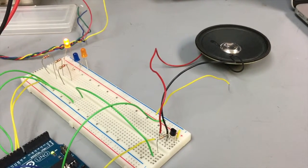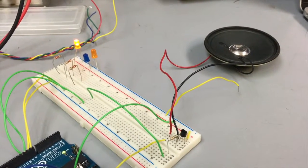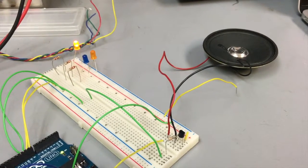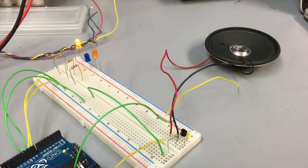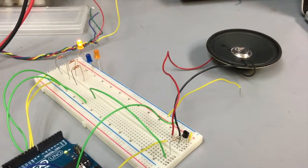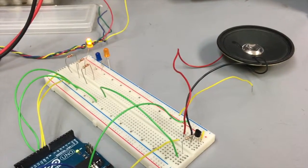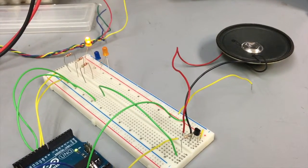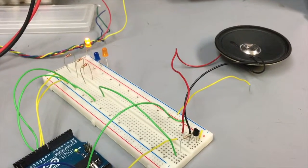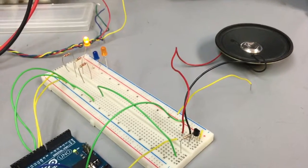You're also noticing one of the side effects that we're going to be mentioning inside of our paper. Sometimes what ends up happening is when you cross one of the thresholds, LabVIEW sends a little bit of information over to the Arduino, and there's a delay in that send process. It kind of keeps LabVIEW all tied up, and because of that, it ends up calculating the beats per minute wrong. So sometimes when you cross from boundary to boundary, there's a little bit of a fluctuation right around that boundary, and then it ends up stabilizing a couple of seconds later.